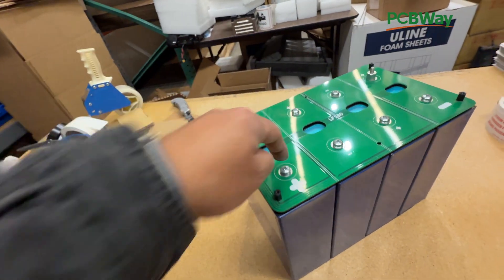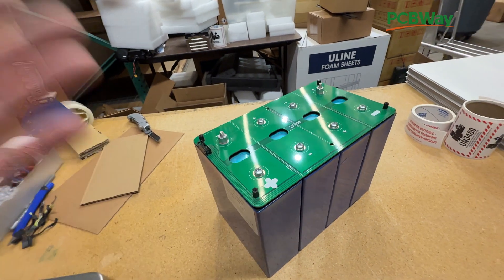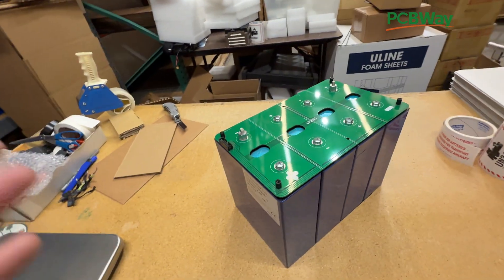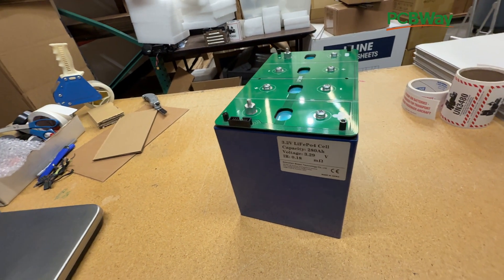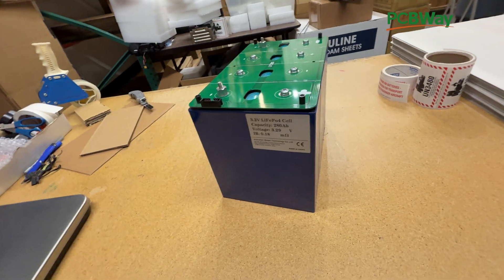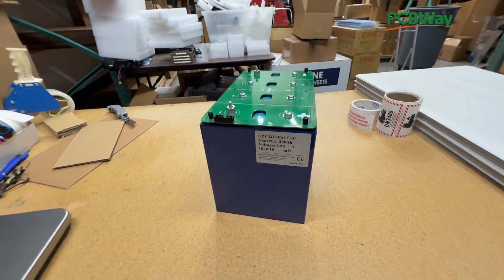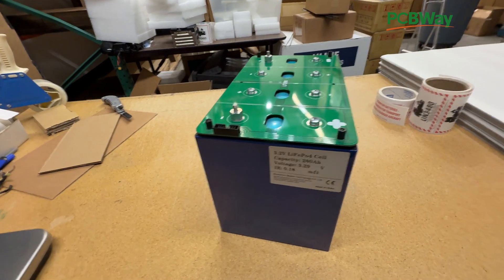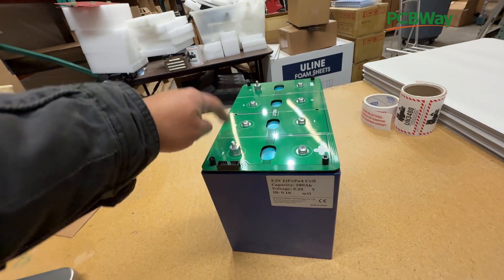These are open source — you can download the files, adjust them, and modify them for your own applications. I'm just helping the community that makes batteries, making it easier. A bus bar like this allows someone to build a very quick, easy 12V battery that you can use for many years. Even though we're about to be hit with tariffs, after we recoup from that, these are still going to be the most affordable batteries. There are no-name brands and smaller shops in China, but also huge companies making these like EVE, LiShen, and CATL. Just make sure you pay attention to the cell size before you order your bus bars.